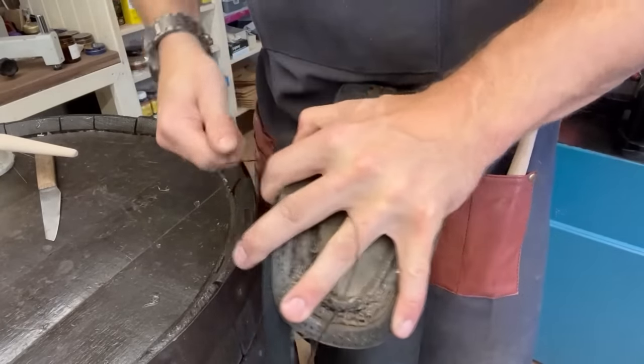Some repairers let this dry for 24 hours and then sand it flat on the machine, but it's not practical for me to wait, so I just make sure it's flat by running the hammer over it — you end up with the same result. I'm going to keep the boot on the last for a minute while I put some glue in it, because it's a big chunky thing and we're doing two layers — a leather midsole first, and then we're going to move on to the chunky leather outsole. Let's get sticky.